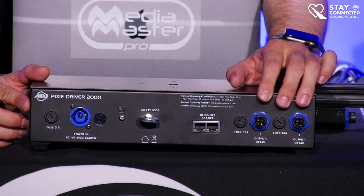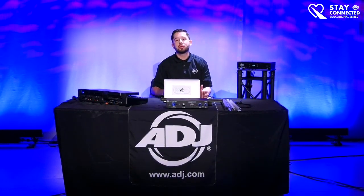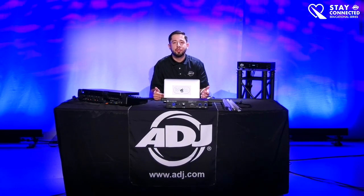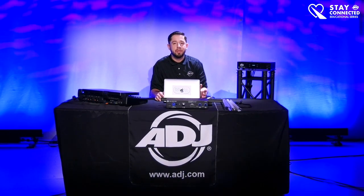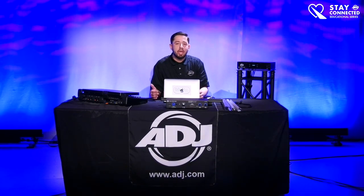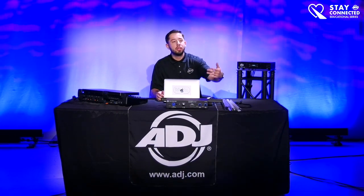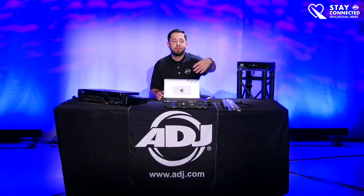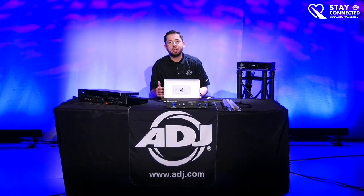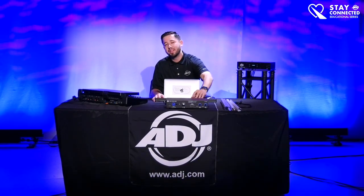So again, that's where we're going to touch on the cable length for the situation. With this being your power out as well as data, you're limited on the actual distance that you can run from your driver to your first unit. Your max cable length is going to be 50 feet, no further than 50 feet, because you're either going to lose power droppage or signal droppage. It's all in one. In between units, your max cable length will be 30 feet. Again, if you're now feeding multiple units after your first unit in line, you're just passing along the power that this driver is distributing from the first unit down the line. Because of that, you can't have a cable length longer than 30 feet from one unit to the next. Again, that's between Pixie sticks themselves, or Pixie strips themselves, should I say.